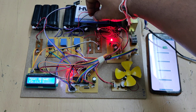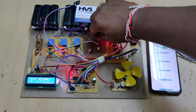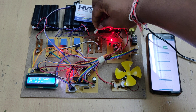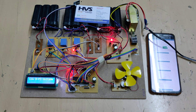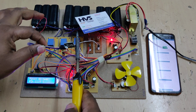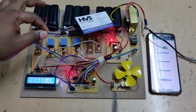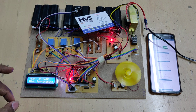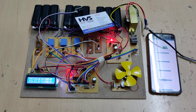Now let us isolate battery pack 2 and battery pack 3 to demonstrate the same operation for each. Next, for the temperature sensor — it is continuously monitoring the temperature inside the battery pack. When the temperature crosses 43 degrees Celsius, which is our set threshold, the cooling fan automatically switches on. When temperature returns to normal, the fan turns off.